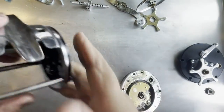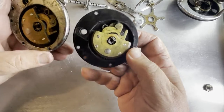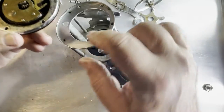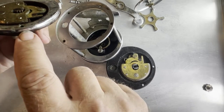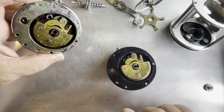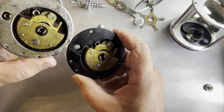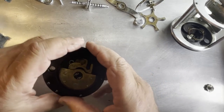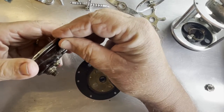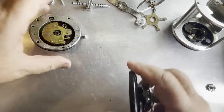We do need to rip this one apart. That gives us this side plate, and when we compare it to this one - oh, there's a part we're going to have to take also, because no, that's part of this frame on this one. That trim ring is part of this one; on the other it's built into the frame. All right, everything else seems to be the same except this one seems to be cleaner. One thing that can create havoc is the eccentric being loose - that one's tight, this one is tight as well. So we're good on the eccentric.